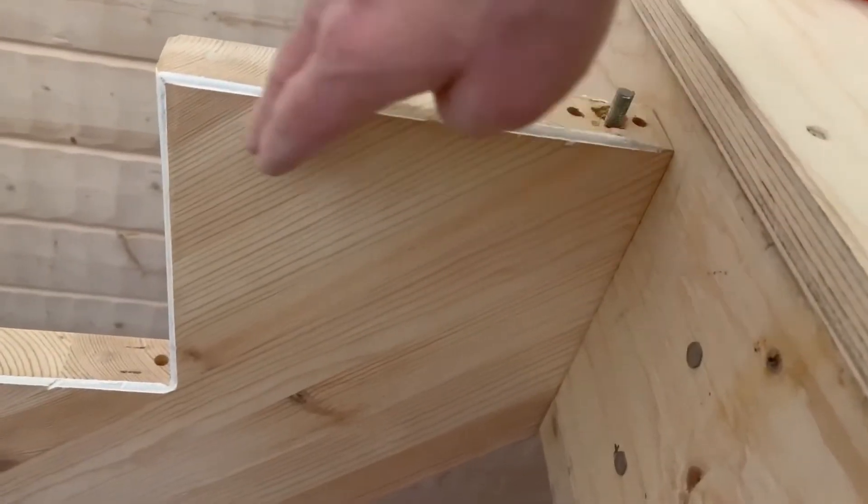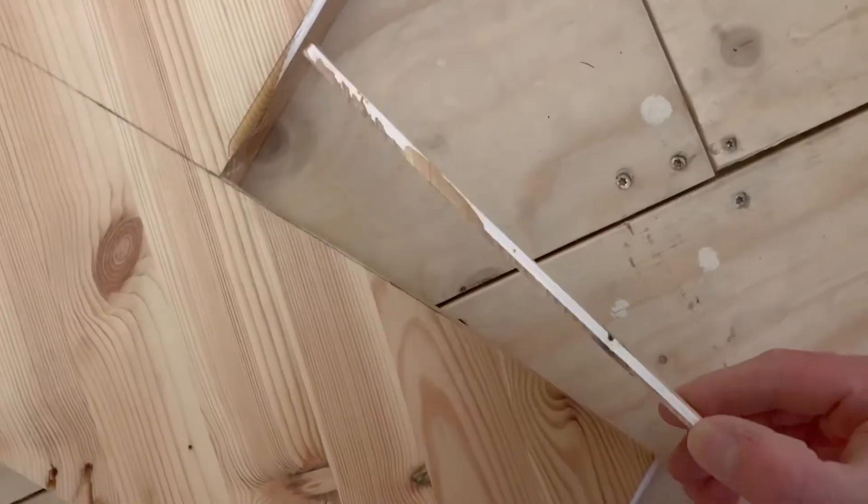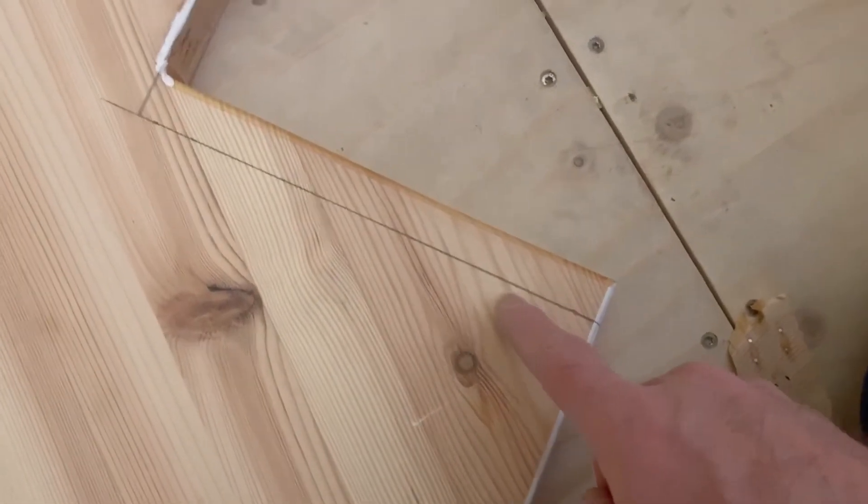I just need to take a little bit off each step, and here's one I prepared earlier. On this first stringer I just took a very small sliver off. That one's done, and then I've measured up the second one and continue on through the rest of the stringers. In the model it's perfect — I drew it up, came back in here, took a couple of cross measurements, and they were spot-on.